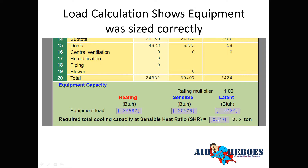The 3.5-ton unit came in at 3.6 tons in the calculation — pretty close. If they replaced the windows, we could probably get this down to 3 tons. The 0.70 fudge factor is appropriate for a 1978 home because of the construction quality. For a newer home built in 2006–2007, you could change the default to 0.75 or 0.80 since the construction is better and less oversizing is needed.